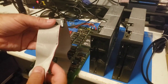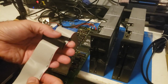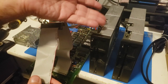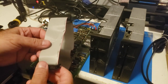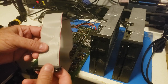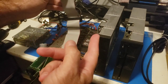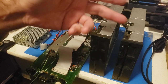I replaced the ribbon cable with a straight-through - there's no twist in it. The twist was put in by IBM in their early drives so you wouldn't have to use a jumper to select drive one or two. The twist would do that for you, so the cable decided which drive was one and two. But the SD doesn't quite work that way - it uses a straight-through cable and depends on jumpers on the drives to select which one is the primary and which one is the secondary.